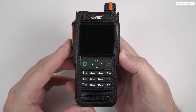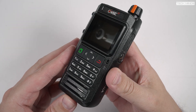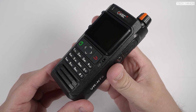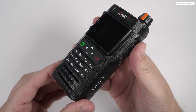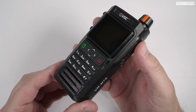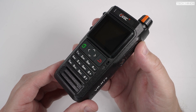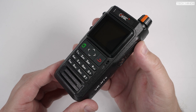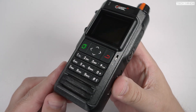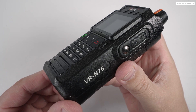The N76 has built-in GPS and a fully working APRS beacon, meaning you can broadcast your location over the APRS network via RF. You can even use the companion app to send and receive messages and view on a map in real time other users that are in range. The companion app also has the ability to access the APRS-IS servers — i.e., the APRS network over the internet — and share this information with the radio, essentially making the radio perform like an i-gate.